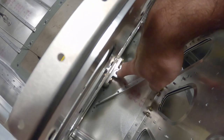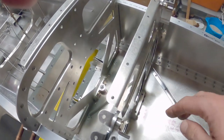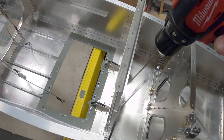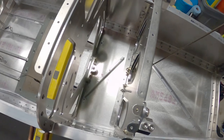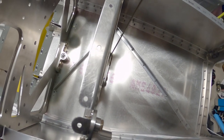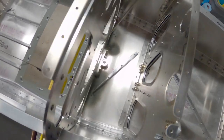I got to thinking and reading ahead in the instructions — where does it tell you to drill the holes for the tail wheel mount? The answer is nowhere. So I figure while I've got access and can drill from this direction rather than hunting around from the bottom with tail skins already mounted, we won't get caught off guard later. We'll start out small to keep it straight, especially on these 3/16 holes. We'll get the hole started this way and then match drill on the bottom side, because there's no way to get a standard jobber-length drill down there straight — maybe here because there's a big opening.